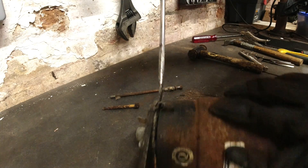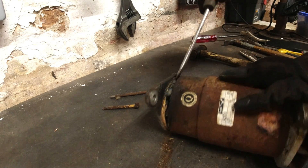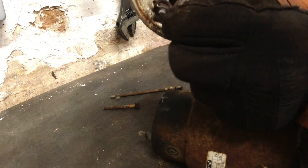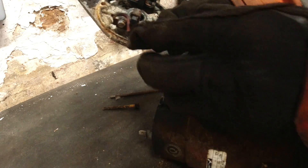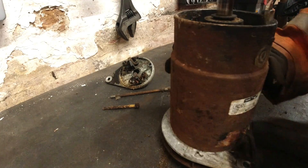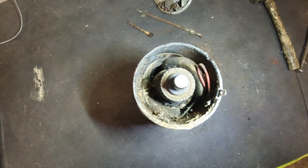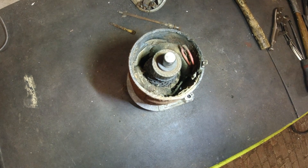There's quite a lot of corrosion in here, I can see that straight away. Let's see whether this is going to be fixable or not. One of the brushes is pretty much worn and frozen; the other brush looks free to move, but yeah the brush should have moved, so that could be part of the problem. Let me grab a torch and I'll show you that a bit better — really badly corroded. I'll keep stripping it down and see what we're left with.